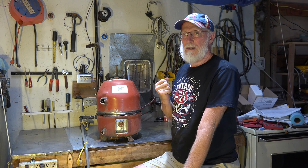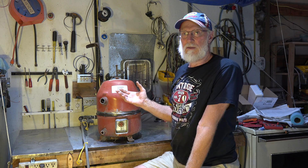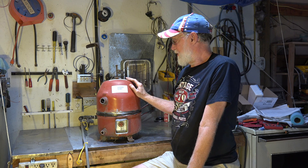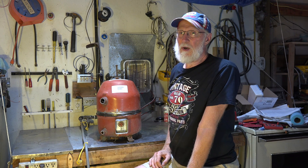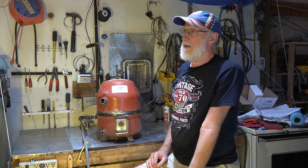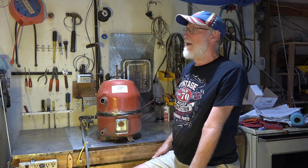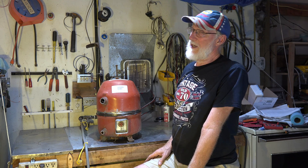The other two types are semi-hermetic — I don't have one intact here. A semi-hermetic is similar to a hermetic in that it's all enclosed, except you can unbolt it. The other type is the open compressor. The open compressor looks more like an air compressor in a shop — it's got a separate motor, a compressor, and is either belt or direct drive. It's usually only used in very large systems, and you don't see many of those anymore.